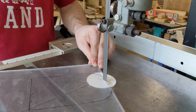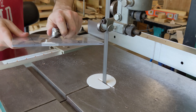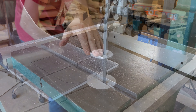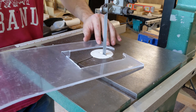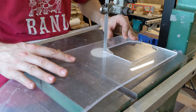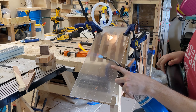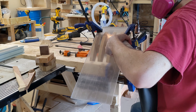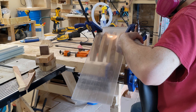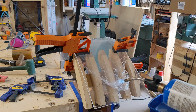Knowing a bit about how this baffle and cyclone separators worked, I wanted to use a clear wall to examine blockages or other issues — also, it's fun. I chose ¼ inch polycarbonate for strength and for visibility, and then bent it to shape using heat and a jig I made. The heat gun took forever, so I looked it up and not only is polycarbonate not flammable, it is self-extinguishing. And don't worry, I took a big sniff before I put on the respirator to inoculate myself.